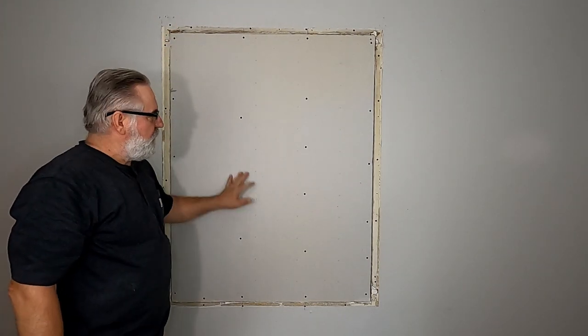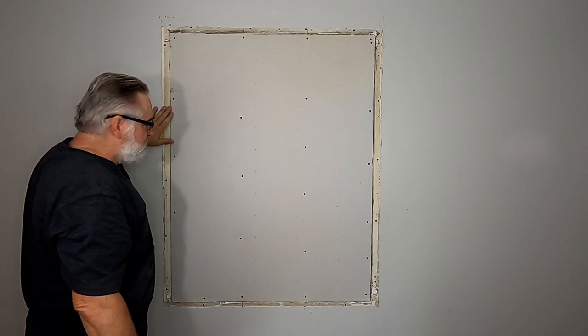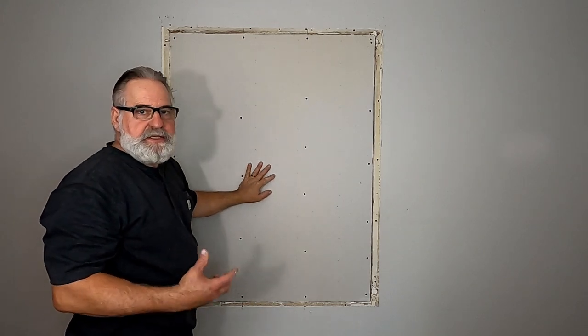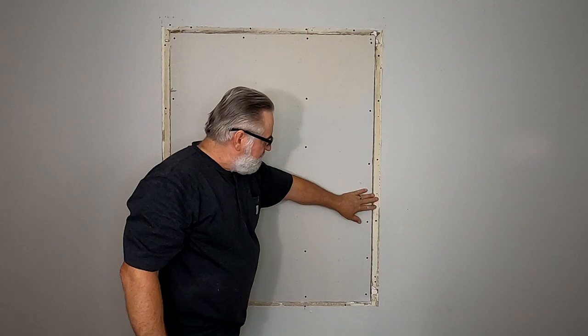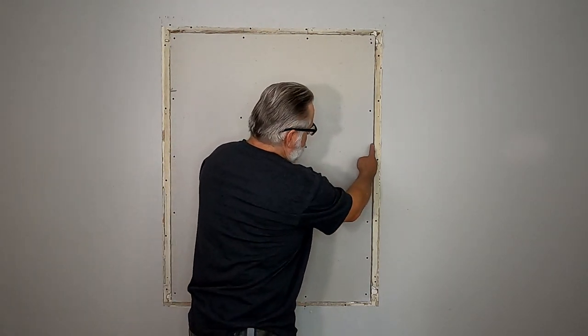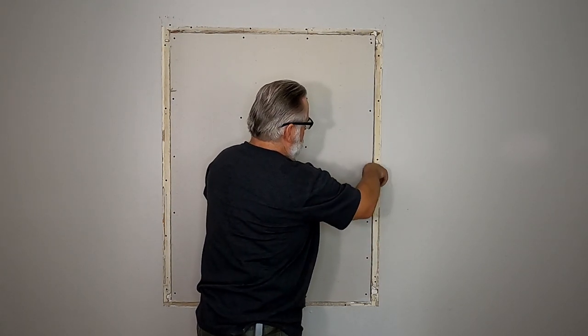Ready to start floating it out. Now, I could just put regular drywall mud here. I like to tape with regular drywall mud because it has adhesives in it rather than hot mud. But I'm gonna use hot mud first. I'm gonna go over this with 5-minute mud to fill in all these gaps because I could just put regular drywall mud in here and tape it.